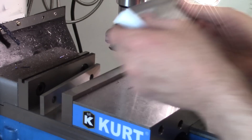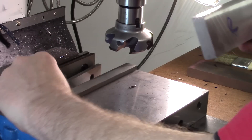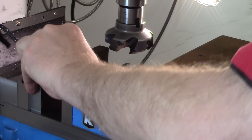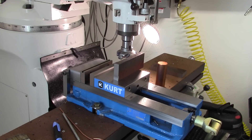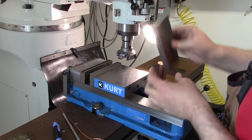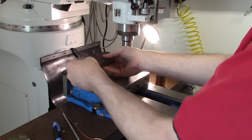So now we're going to take this off and take this burr off real quick. Make sure our vise is clean. You can see how that scale looks like rust all over everything, but we do have a good surface. So we're going to put that in there. While I was on the phone, I rethought what I was doing and decided I was definitely not doing the right thing. I was going to try to make it parallel to this, but I really don't have a good enough square side here. So what I'm going to do is use this reference and make this one square to that, then flip it over and make those parallel so I can hold it in the vise and do it right.